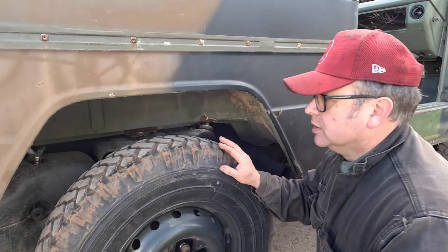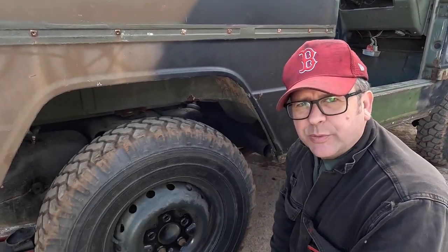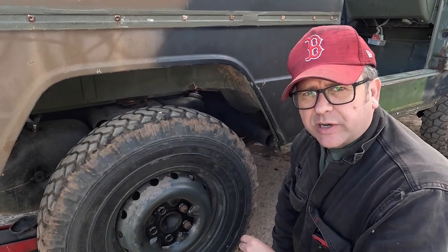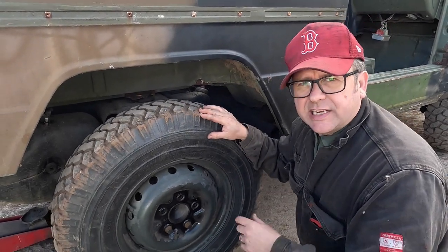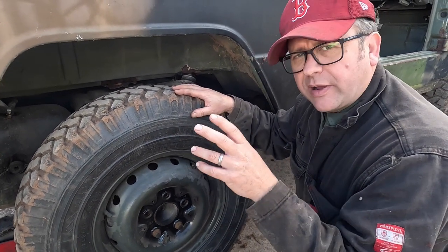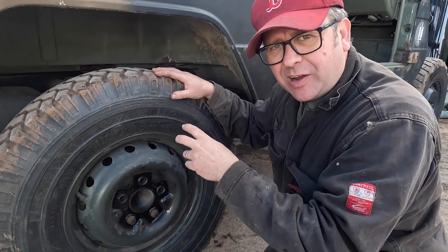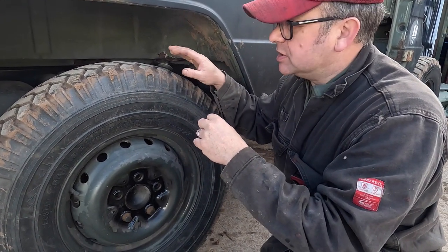Okay, there we go. So there's nothing wrong with that bearing at all. That's absolutely silent. We've got a slight, as I said, brake drag on it. So let's go and investigate now the rear axle. And how we do that is we're going to chock, or in fact Ollie's going to help me and go on the other side. We're going to spin these wheels at the same time in the same direction, because at the moment it's just using the diff.